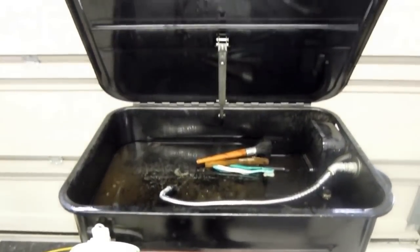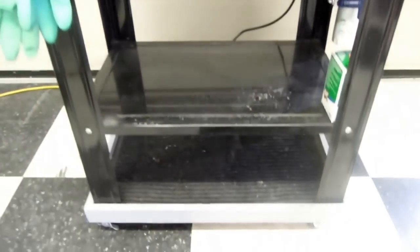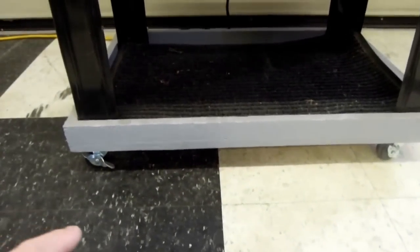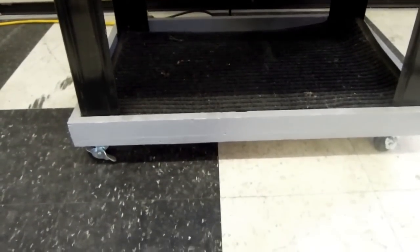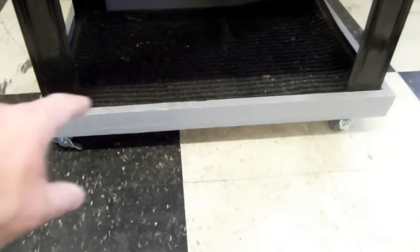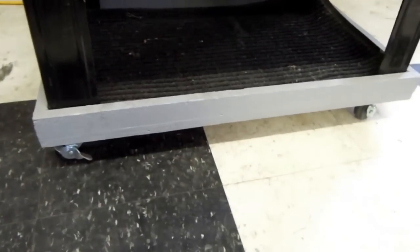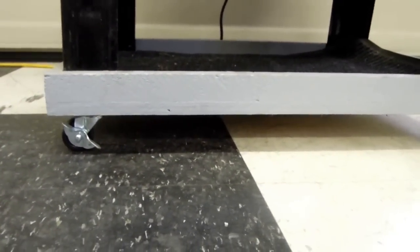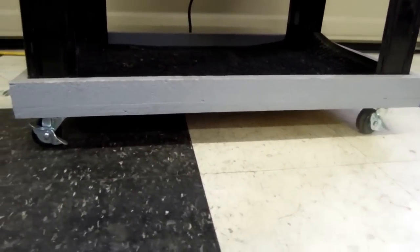The first modification I wanted to share was the base — a movable base that I made out of plywood. I used three-quarter inch plywood and I think those are one-by-twos to create the lip you see here. I measured the outside of the base, sized the plywood accordingly, and bought four inexpensive casters and mounted the unit on them.